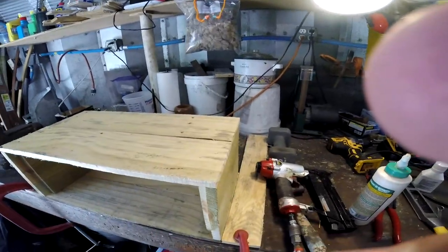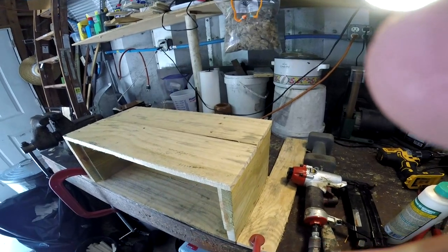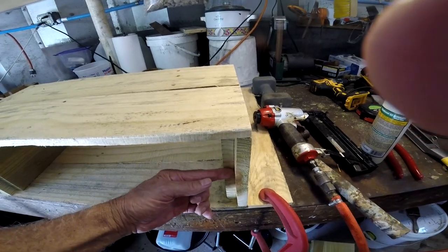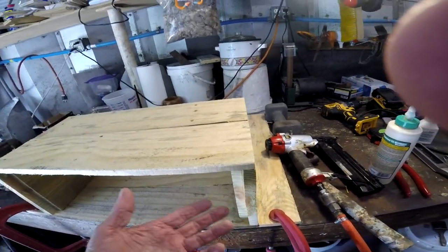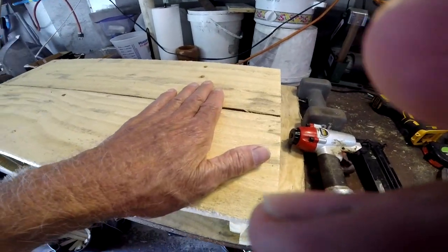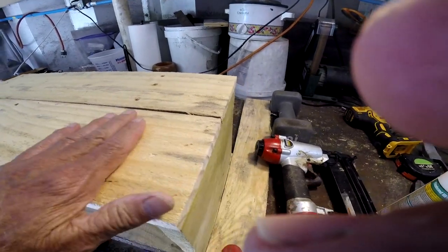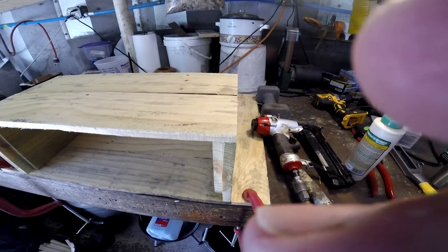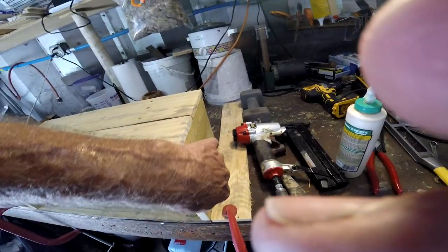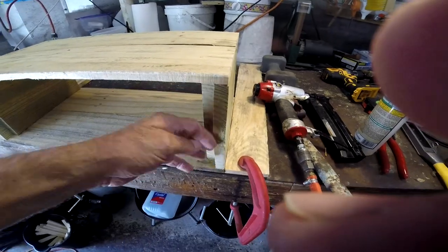Just set your blade. I do this on a table saw. No dado action, just a single thin blade. And I raise the blade off the fence, 3/4 inch high. All I do to do that, I got some scrap piece of 3/4 plywood I set right on top of the deck. Then I bring that blade up till I feel it flush with the top of that plywood. Then I set it. And then I move my fence back 3/4 inch. So you just plow this, take this 10-inch high board, lay it flat, run it through, flip it up on its end, run it through again.